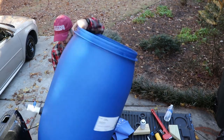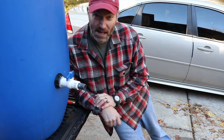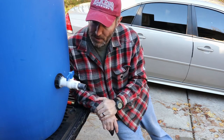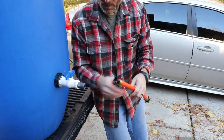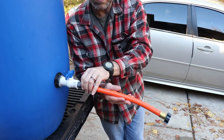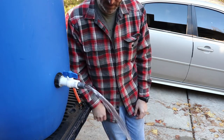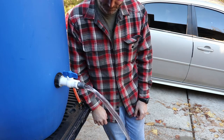Alright, let me go grab the hose, we'll fill this bad boy up and see if she works. There you go — I got the water level up to about here. No leaking here around this gasket, no leaking here. Now time will tell if this is going to hold up or not. I feel pretty good about it — this bulkhead fitting is pretty tight. Of course you can open that up, we got water. With this three-quarter inch fitting you can just hook a hose on here. No leaks, everything looks good.